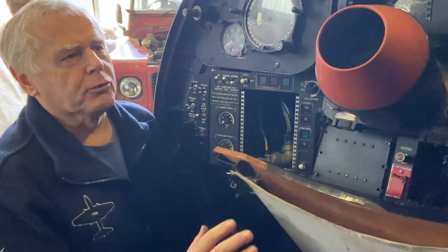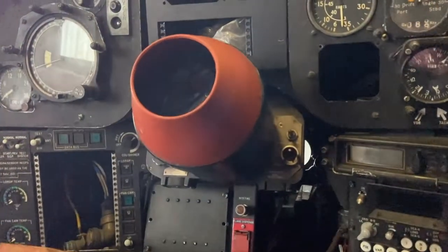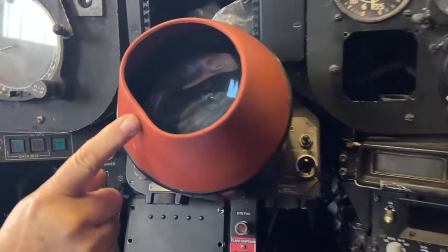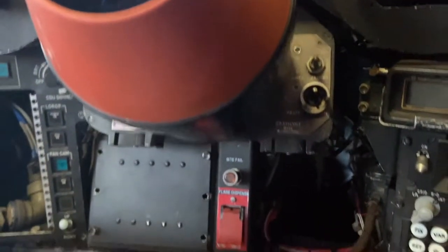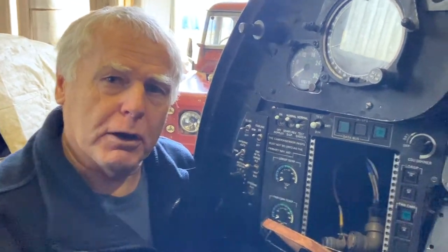If you look forward to where you are, this is where the navigation piece sits. This big orange piece here is the actual recce viewfinder. Under the nose is a prism, and you've got a handle on the right-hand side that allows you to turn it to look fully forward, which is what we use at low level, or vertically, which is what we use doing any of the medium level stuff — because at medium level you're tracking the aeroplane over the ground, and you know the angle the camera is looking at. That's how we calculate the standoff from the target.